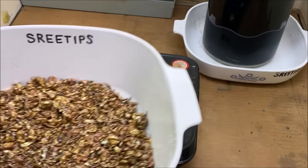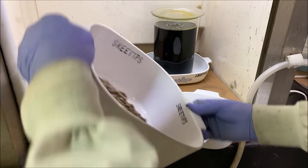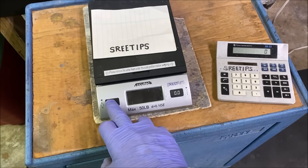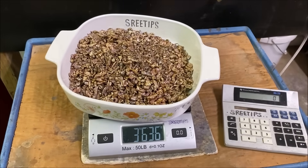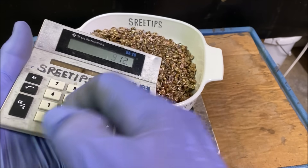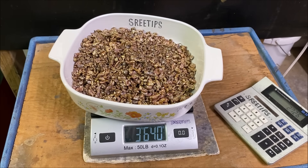Here's what we've got melted up today. I'll put it on some low heat and let this dry. I've got this all dried off now — this is the stuff we melted up today. I'm going to transfer it into this smaller dish. Let's get a weight on our material. I've got the tare weight written on the side of this dish — 912.5 grams. So 3,638 minus 912 equals 2,726 grams of impure silver shot ready to go through the silver cell.